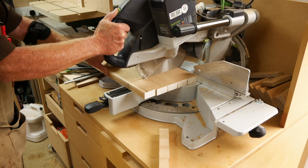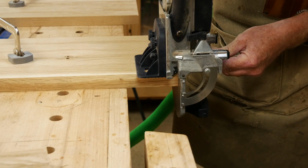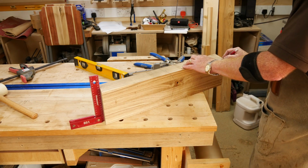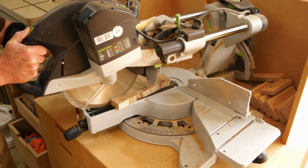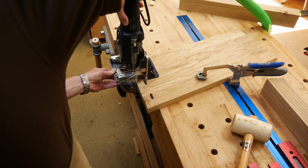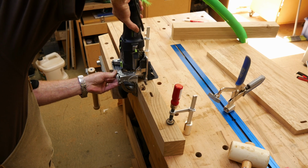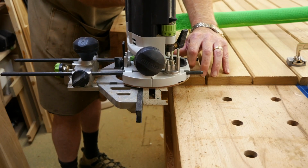Now I can cut the front rail to the same width as the back panel, and then cut the domino slots to join the side rails to it. The back legs are cut at a 10-degree angle, and then cut the back of the side rails to suit. This is mistake rectification. I should have cut this piece off earlier before I glued the back frame together.